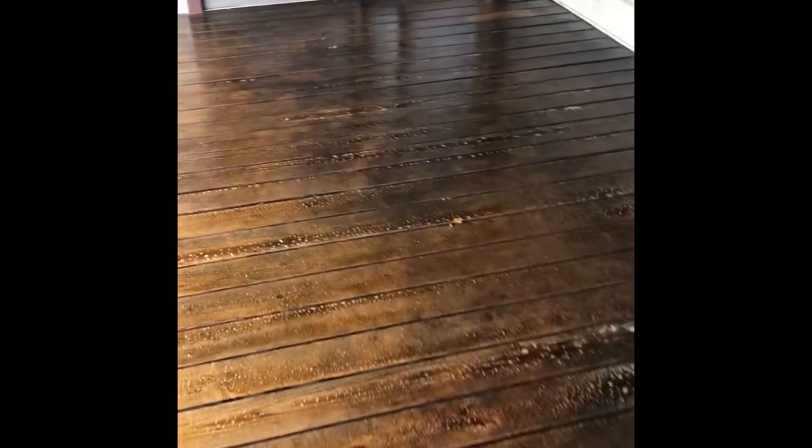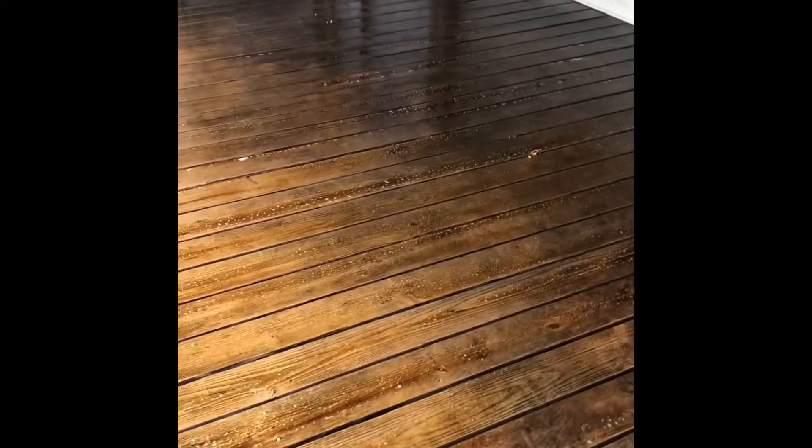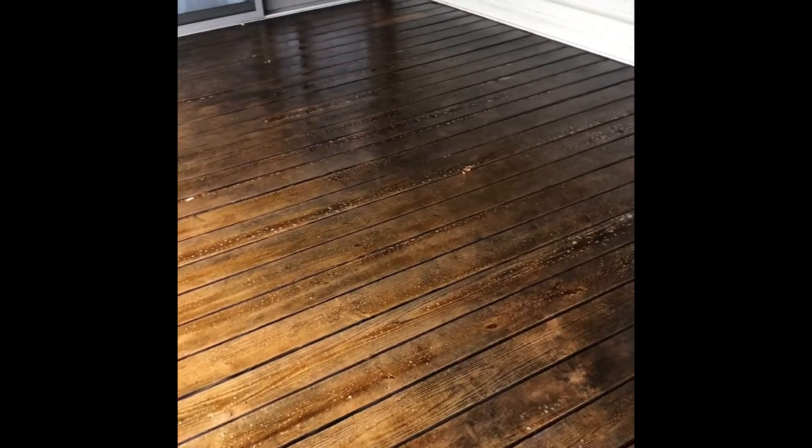We are back. It has been about 10 minutes since I applied the stripper to this deck. As you can see, you've got a little bit of bubbling action. In some of these areas where it's really on there and you don't have the surface broken at all — like the area under the porch where it's not seeing sunlight — you want to check and see if your stripper is actually working, doing its job.